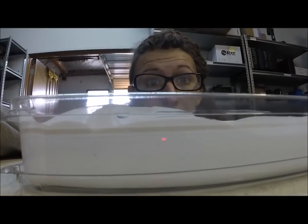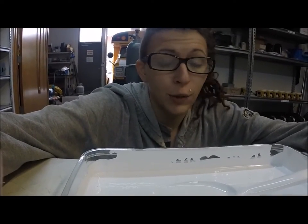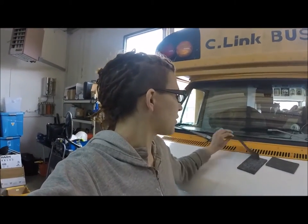Once you put the hardener in the tractor and implement paint, it has to activate for 30 minutes, so you stir it real good at first and stir it periodically. We're using Scotch-Brite pads for in-between coats — these are working really well — and for the more tough burrs and stuff we have 800 grit sandpaper.